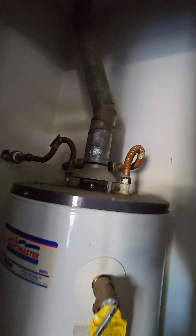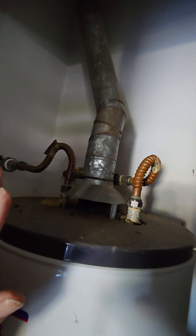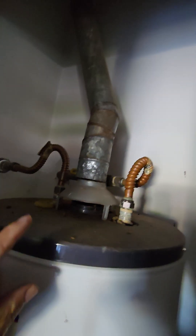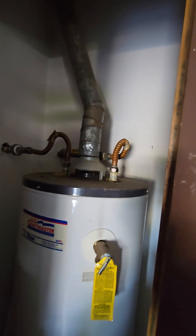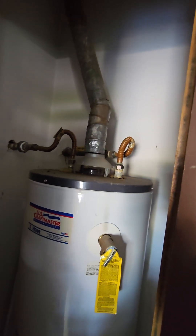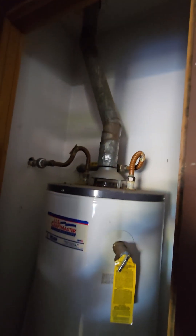That's all minor, not real big — real simple. But the biggest one, which is also a simple fix: I opened it up and I smelt gas coming out of here. My pipe is not connected to my chimney pipe, so we are having a leak and you can smell the exhaust. If we had a carbon monoxide detector, it would be going crazy right now.